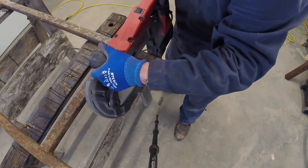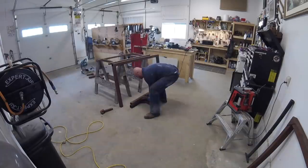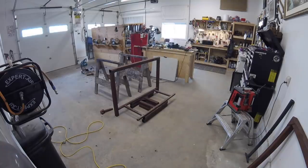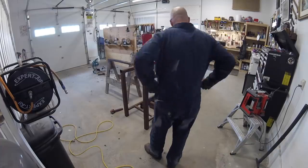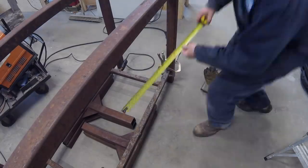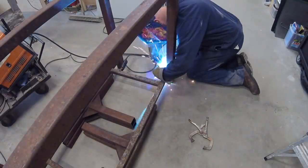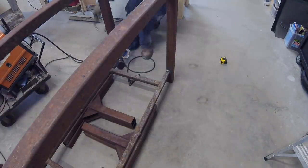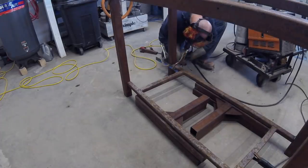The bottom of this shelf is going to be this piece of steel — it was actually a fabricated motorcycle lift table that I made probably about 18 years ago. I took it apart, didn't use it anymore, but I kept the steel. What I'm doing right here is just taking the legs off those big arches and using those to shim up the lower frame. This is as simple and bush league as my mock-up goes — I check everything, make sure I've got the same dimensions from side to side, check it for level, and then I'm using a piece of flat bar to keep the inside edges flush when I tack and weld it together. I gave quite a bit of care cutting that bottom piece square, and the same with those arches — it saves a lot of time and makes the assembly go together very quickly.